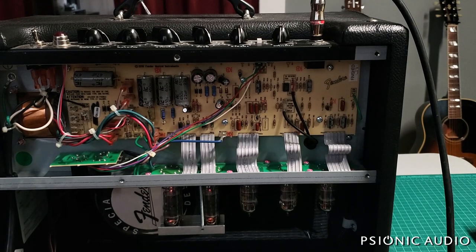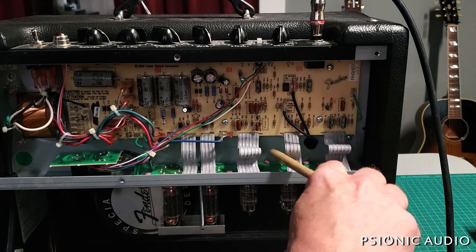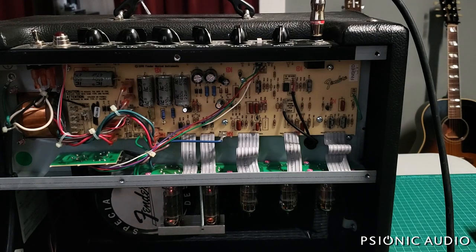But this amp had a couple other things. First of all, it had the hum that you saw me fix in yesterday's video — 'Does Your Blues Junior Hum? Try This Easy No-Solder Fix.' Notice I use the wooden handle of a paintbrush now to move that ribbon cable. A guy got onto me for saying you can use a pencil. Don't stick anything potentially conductive — like the graphite tip or the metal eraser band — in there. You'll have something non-conductive in your house that will work, like the plastic handle of a small screwdriver.